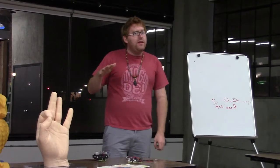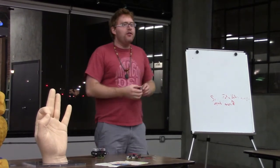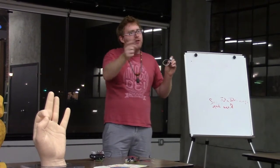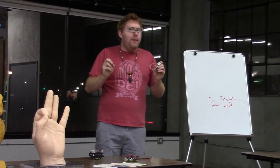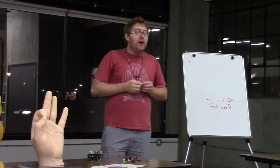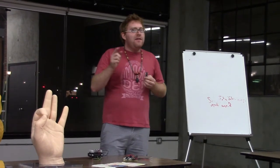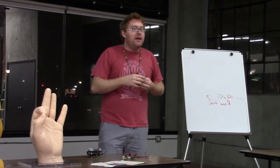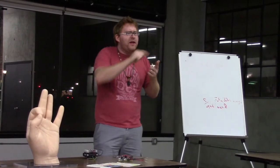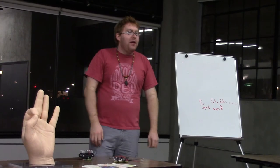They sell a $40 and a $50 version, differing on the number of fingerprints that you can store in its internal database. But it's a great little chip because it does the recognition, the reduction to a template, the 360 degree rotation and checking, so that you can do all of that on board and you don't have to worry about any biometrics code. You just say, register a fingerprint, and do you have this fingerprint on file? Or is this fingerprint user XYZ, where you assign the number for your user? You don't have to worry about which 10 points on the fingerprint you're going to use, or whether it's rotated the right way to trigger the lamp. It handles all of that, which is really nice.